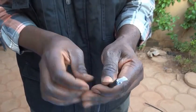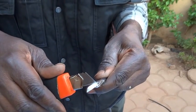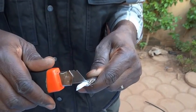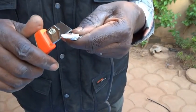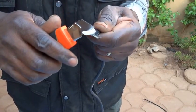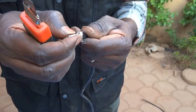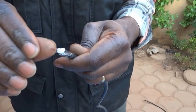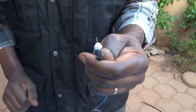Now the next step — this mesh will convey one signal. Counting something like 0.5 centimeters from the extremity of the inner coating, I make a cut — not too sharp, otherwise I will remove the central wire that I need. So I make a very light cut following the circumference. Done properly, I must be able to remove the white plastic coating, leaving the central cable exposed. But if left too long, when I want to connect and lock the F connector, the extremity will come inside and touch the device, preventing me from locking it. So I cut only about 0.5 centimeter above the extremity of the white plastic coating — that is enough.